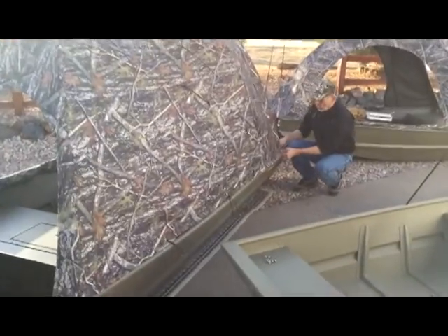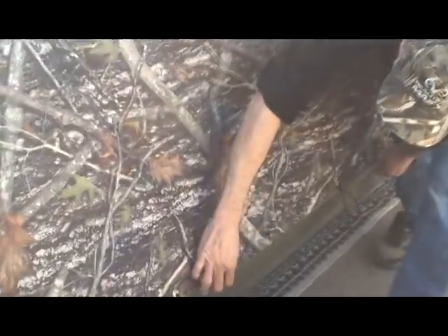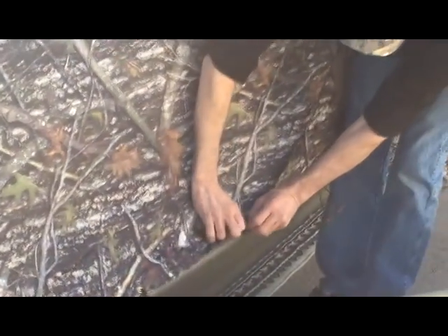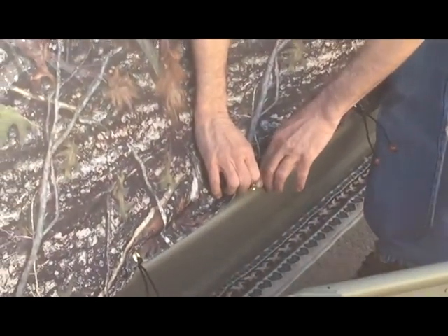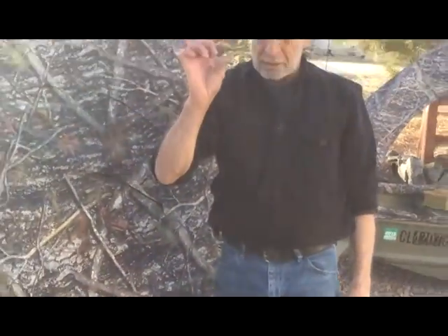After all four corners are in place, put some pieces in the middle to hold down as well. Then coordinate exactly where the snaps are in the cover, mark your side gunnel, drill an eighth-inch pilot hole, and install the stainless steel stud supplied.